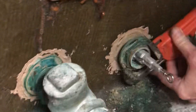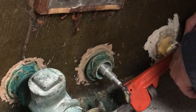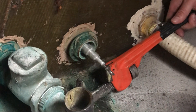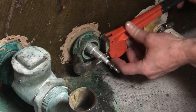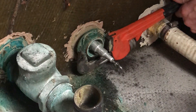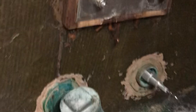The best way to disassemble a through-hull is when you have space — the nut actually comes loose and you can hold it on the outside with a tool. That's perfect, but it doesn't always work that way. The tech tip for using a step bit is great, but we wanted to try and save and reuse these bronze through-hulls. The plastics were all shot and being replaced anyway.